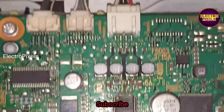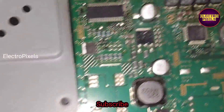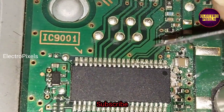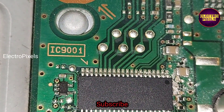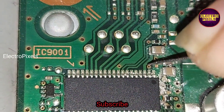To remove the backlight protection, we need to cut down the second pin of the IC. After cutting down the second pin, I will show you the result. Using a sharp blade, I am cutting the second pin named as fail pin of the IC.